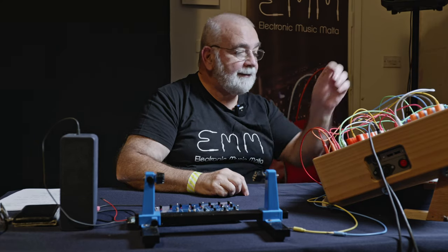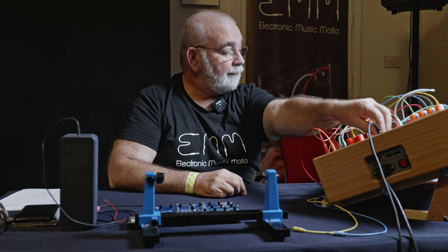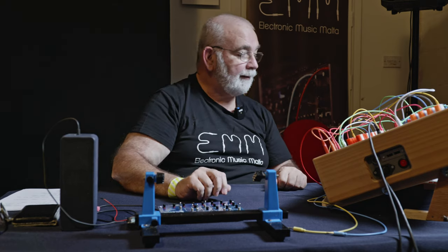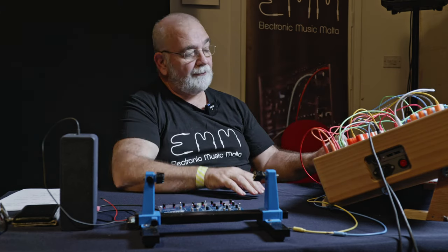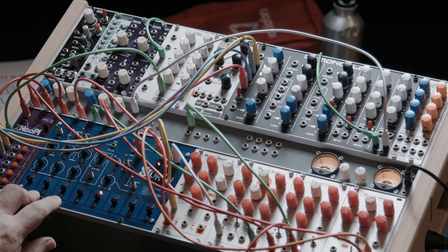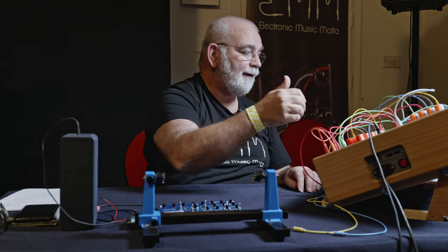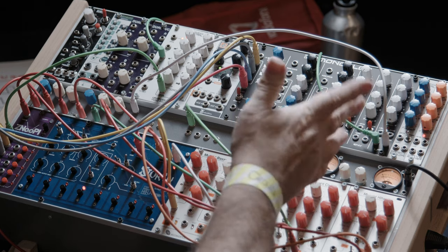Now, so far, we have used the sequencer as a drone within itself when the unit was being used as an individual standalone unit. However, when we change it over to use for Eurorack, we are able to take a varying control voltage from each separate channel so that we control in the same method that we are controlling external voices, we can control an external voltage controlled oscillator, which is what we have over here, so that we can generate a sound from external oscillators.